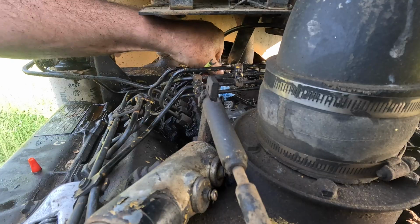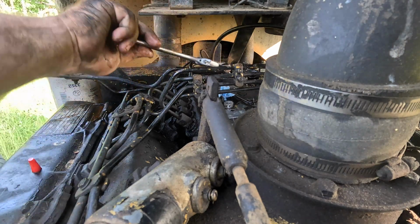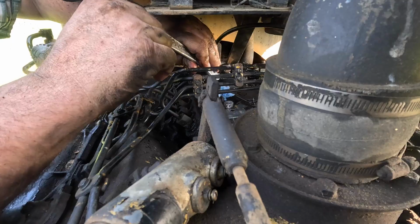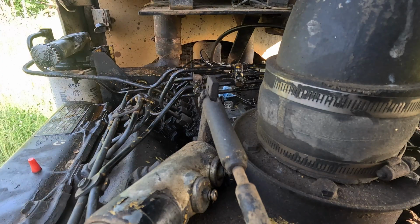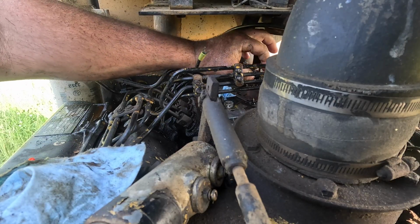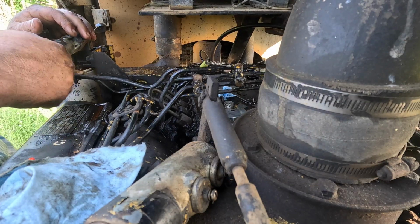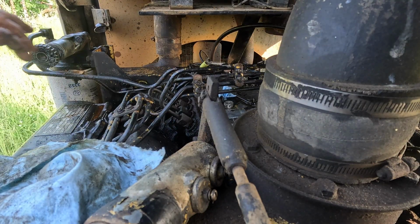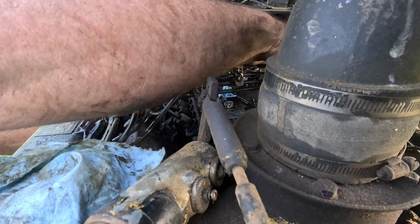The nice thing is this will be all covered with dirt when we go back out there. Because if one thing stuff likes, you know, covered with fuel and then back out in the dirt, why, that's a recipe for success. I'll try to brake cleaner it off. Now I should be able to open this and then primer pump it, and fuel should fill that cavity back up that we just unfilled, and then when it's full it'll come out the overflow tube. I hear it coming out of the tube. Oh yeah. Okay, we're done with that.